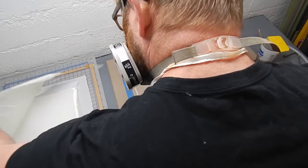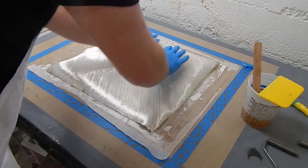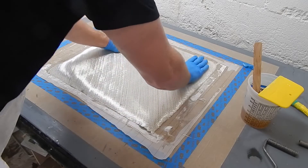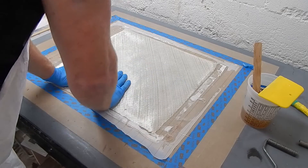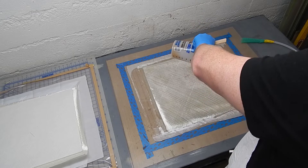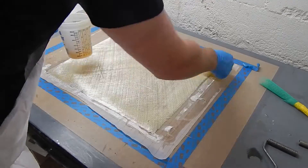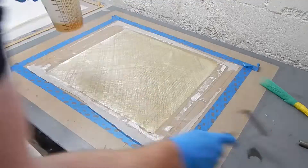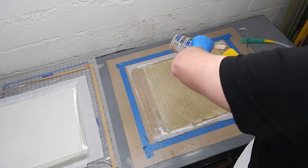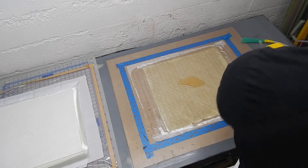Here goes the biaxial 12 ounce e-glass. It's been right on the end of a roll wrapped tight around the cardboard so it's pretty stiff and doesn't like to go flat, but the resin will help and the vacuum bag will take care of it. I'm going to put a little more resin on this bottom skin than might be ideal, just because I'm not sure how it's going to work. You can see it wet out here slowly, and pretty much what it takes is time rolling in resin — you can't really rush it. If you don't get it wet out, the vacuum bag is certainly not going to add extra resin.